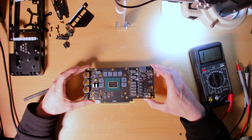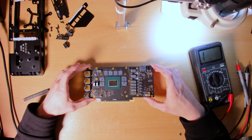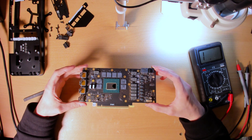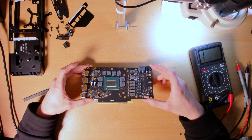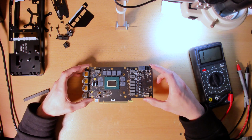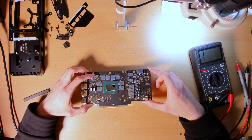If you wanted to know the resistances of certain voltage rails on this card when you're trying to fix one, there are the resistances you should expect. I reckon the resistances are going to be similar on the A770, though maybe with an ever so slightly different resistance on memory because it uses different memory chips.